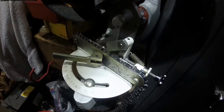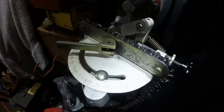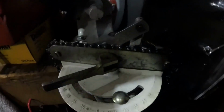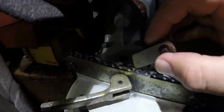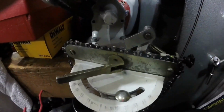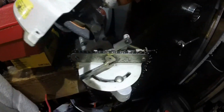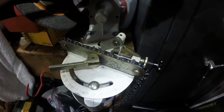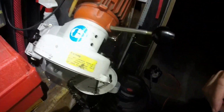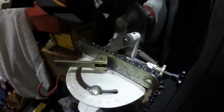And so on a softwood, a longer or more extreme angle, I guess you'd say, a 30-degree cut is more beneficial. But if you're cutting hardwood, oak, eucalyptus, or something like that, I've heard that if you sharpen at 25 degrees, that broader cutting tooth tends to not dull as quickly. So I don't know how effective it is in cutting, but I've experienced it myself with regard to the cutting angle and the broader cut on the sawtooth, or the lesser angle, does well under hardwoods. The tip on the edge of the tooth is not as sharp and doesn't get as rounded as quickly.